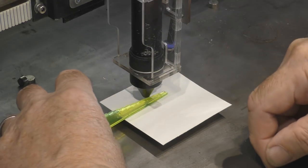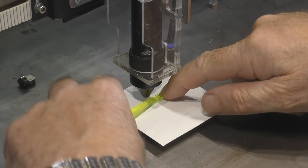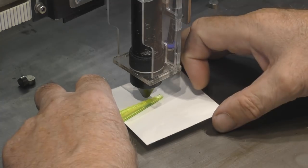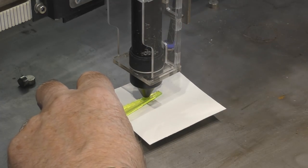This is the two-inch gallium arsenide lens that I've got in here at the moment, and what I'm going to do before I start any work is to just find out where the correct focus point is. Now to determine the focus I always use my little dot test — it's the most accurate thing I've found for determining the focus, and you can get it to within half a millimeter.